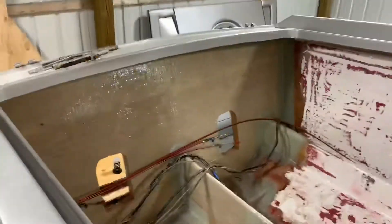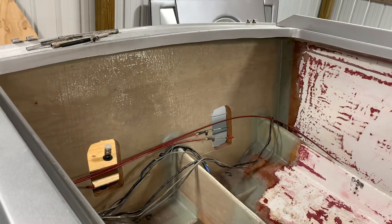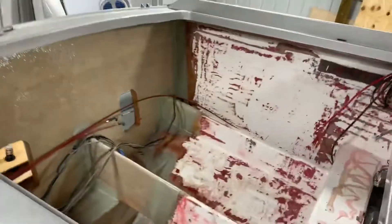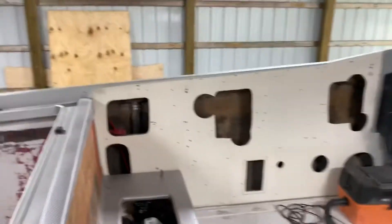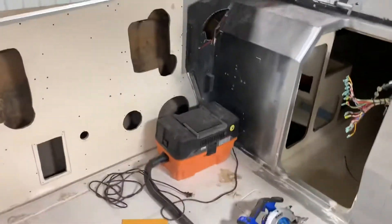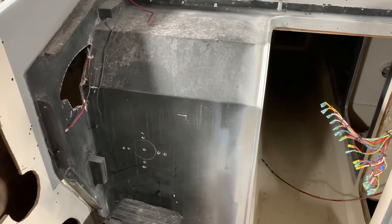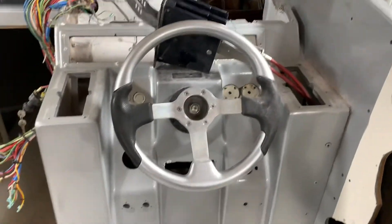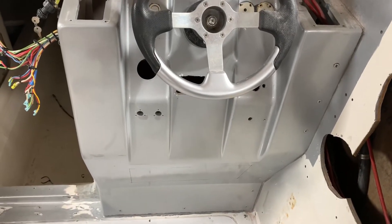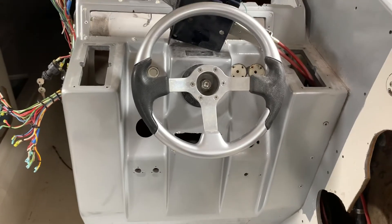We already have the real nice interior as you guys saw in the other videos — we redid all that. So we have a real nice transom, we're going to smooth the bilge all out. We do run that 575 hatch on this boat, modified for this straight bottom. Coming inside, as you saw in the previous videos, we do have an electric slider on this door — that's all out for modification and paint. Now we're working on getting this aft piece out, and in my next video I'll show you why and how that's coming.